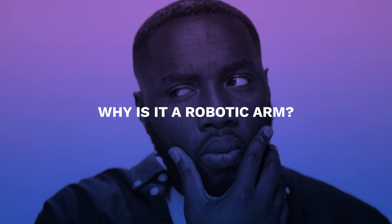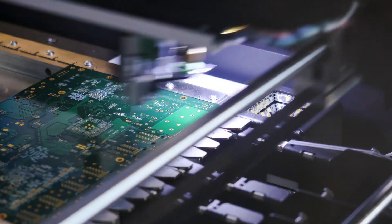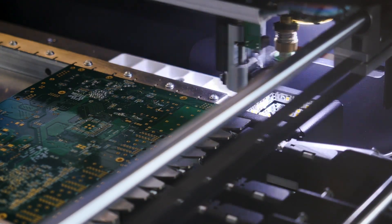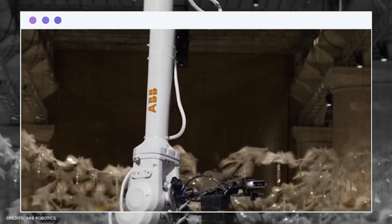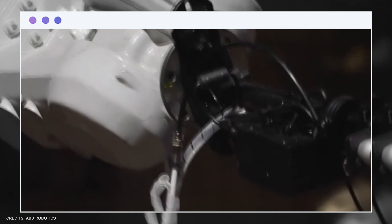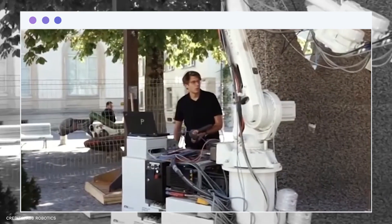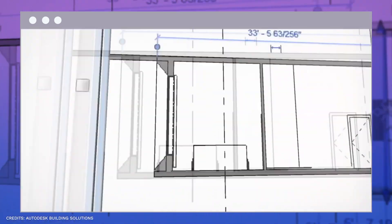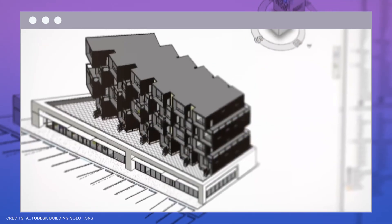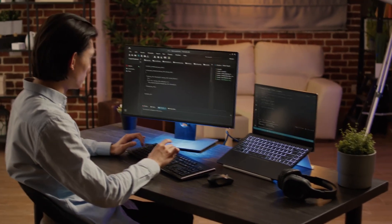The lack of support in most printed items from robotic arm 3D printers further increases design freedom and reduces material costs. This does call for self-supporting buildings, which ordinarily disallow overhanging designs. However, many manufacturers have found a solution by enabling the building platform to be turned around, allowing for the creation of overhangs. A growing number of software options today contain 3D printing modules that significantly reduce the guesswork involved, and improvements to these programs are moving them closer to a true CAD-to-print workflow.